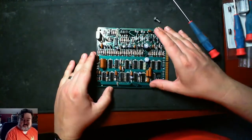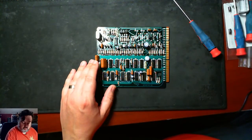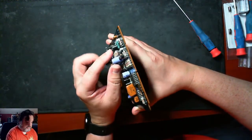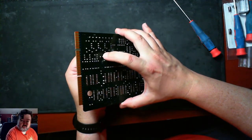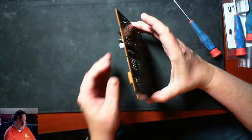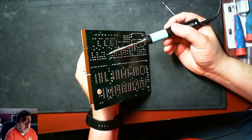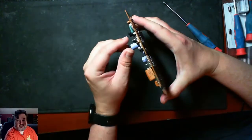I've got my board here. The easiest way I usually do this, working on one of these bigger ones, is you find the two solder points — that one and that one. What I usually do is just take a soldering iron, heat up one leg, and kind of pull or bend it that way.